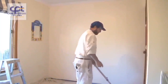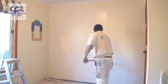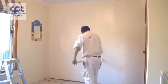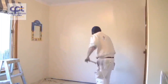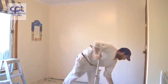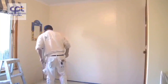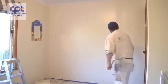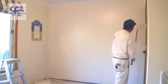Now I've got to there, and it's pretty much just repeating the same process — once again about half a roller width away, spread the paint out. A handy tip: always have your roller tray close by, not on the other side of the room like I've seen some people do. Starting roughly half a roller width away again. Now I'm swapping hands, which you have to do when you get to a corner.